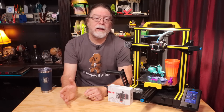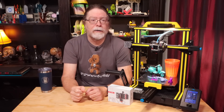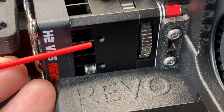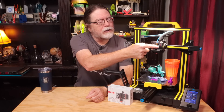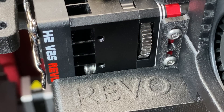On BQ's side, they've made some improvements to the H2 design while keeping the same form factor. They've added additional mounting holes on the front, so you have more options for mounting things like fans or bed probes. The gearing seems a bit quieter, at least to me. It still clicks a little on retractions though — you can wiggle that big gear just a little bit, so I think when the extruder stepper motor changes direction the gear teeth click against each other, causing that noise.